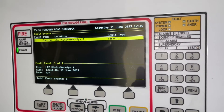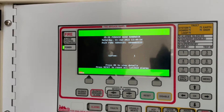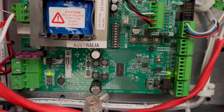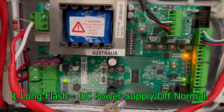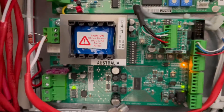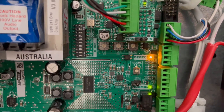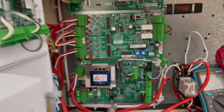All clear — we fixed the problem. However, there is still an existing fault indicator blinking on the amplifier. We count the blinks: one, two, three, four, five, six, seven — seven pulses. We don't know what that means; we'll have to check with the supplier what the seven-blink fault code indicates and what configuration or setting is needed to clear it.